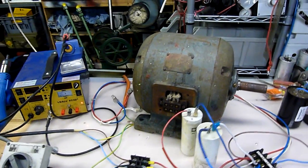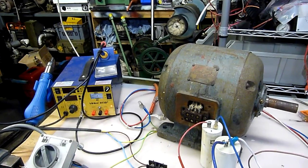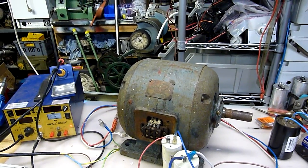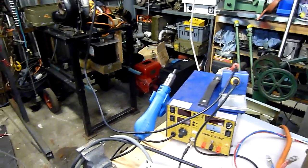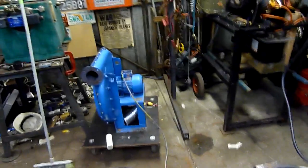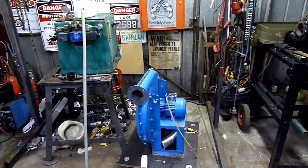It's a long way to go. I'll certainly try a bigger motor if I can find one, but I want it to be delta - not 415 star. I want a 240 volt, high horsepower motor to turn into an RPC. Unfortunately, so far all the big ones I've got won't do it - they're dedicated star wound 415 volt motors. But let's try the blower.